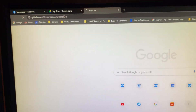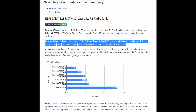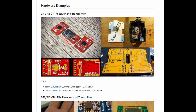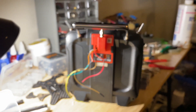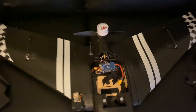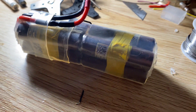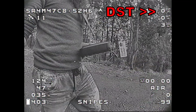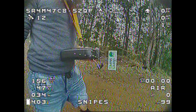In today's video we're going to be pushing the range limits of ExpressLRS, which is basically a custom firmware that can be flashed to the FrSky R9 hardware, as well as some exciting new 2.4GHz LoRa-based gear under development. In today's test I'm using the R9M module with ExpressLRS. My test rig is a Sonic Model AR900 wing, fitted with a beefy 4S2P lithium-ion pack giving us somewhere between 5-6 amp hours. I'm aiming to get out to about 10km and see what the link looks like. Let's head out to the usual spot and throw this off a mountain.